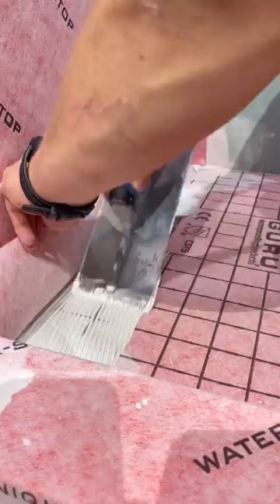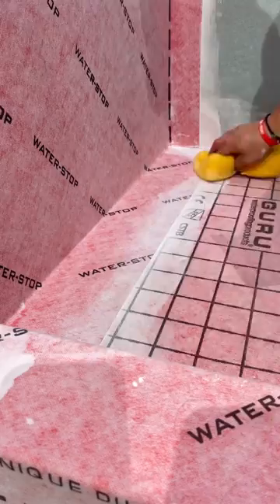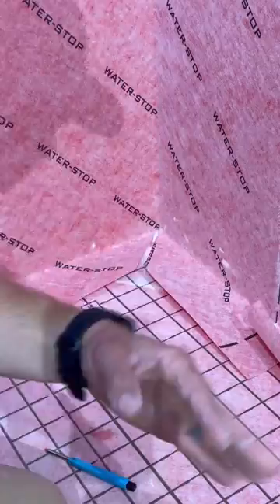There are a few benefits to that. One, you're eliminating having a seam on your shower wall, so if you're installing small tile it's not going to kick that out. Two, you're having a nice big overlap — so instead of having a three inch overlap you're having a five inch overlap onto your pan. And four, it's super clean and much faster to install.